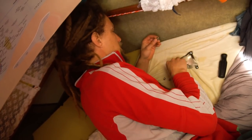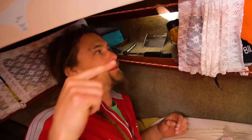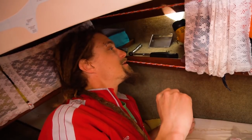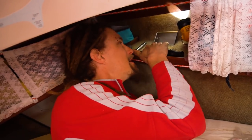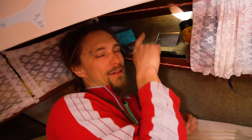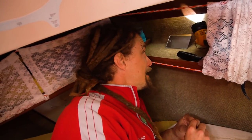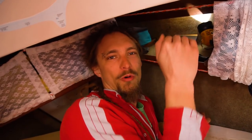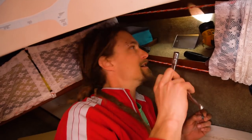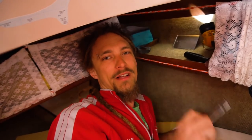So we've got Corey tightening the nuts inside the boat while I'm holding the screw outside — quite the little setup. It's a pretty tight space, about that much of my finger to get in behind for our toe rail and stanchions. Alex figured it all out all by herself when I was working one day: the setup is one mirror so we can see up underneath here, a light so we can see, and then we've got our wrenches. I have to get the washer and lock washer on the bolt first, then luckily a little butyl tape holds it there once I shove it on, and I put the nut in and thread it on, then use the wrench for the first few threads.